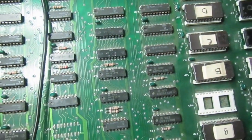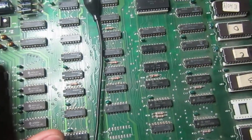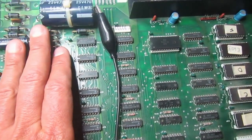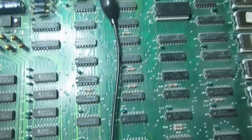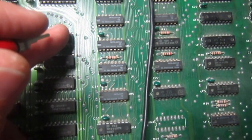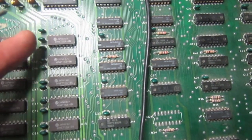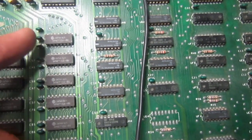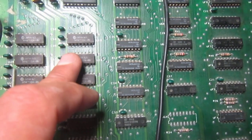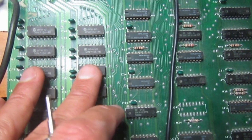This is a 1979 machine and the owner sent me a garbage screen image. I powered it up briefly and verified the voltages on the RAMs. The plus 12 volt rail is missing, so I powered off immediately because these RAMs need three power rails to work correctly. The minus 5 is the most critical — if it's missing, the chips are more likely damaged instantly.